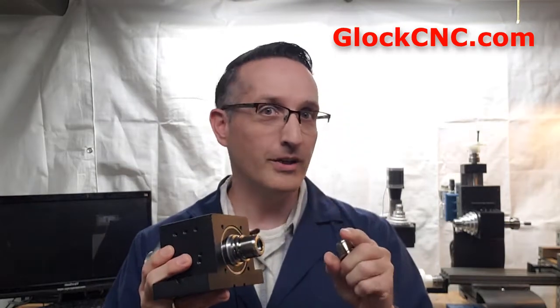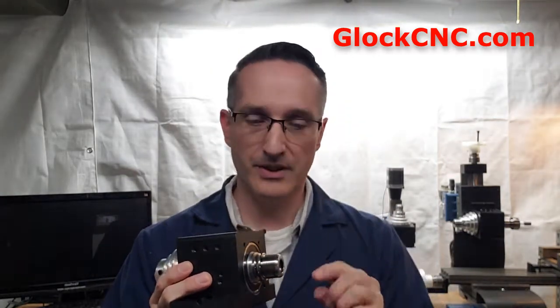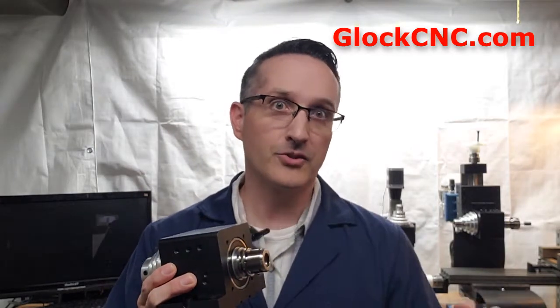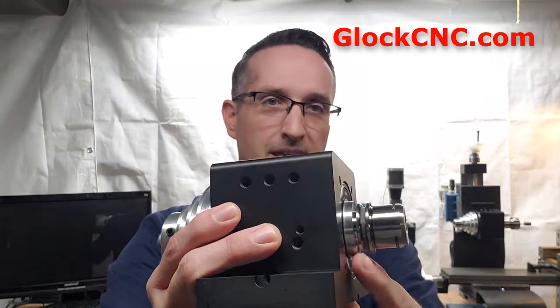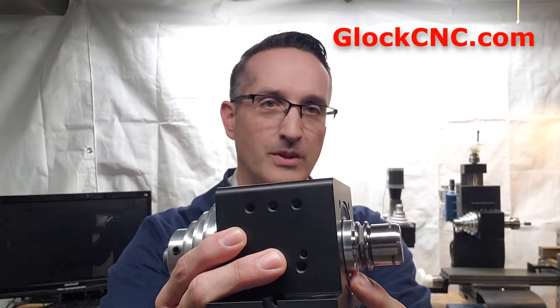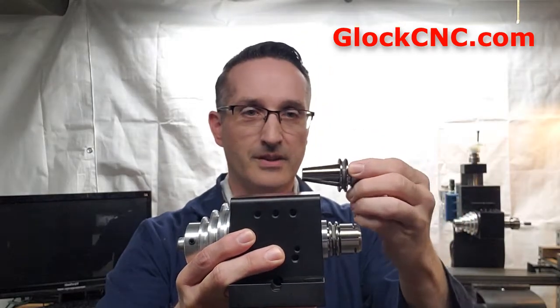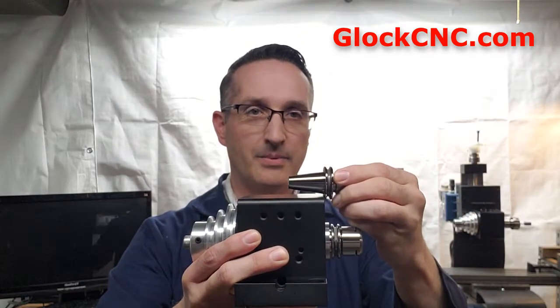The first thing I want to point out that's really unique about this is what's called a snub nose spindle arbor. You can see that's where the spindle ends. That means that this tooling taper fits up into the bearing, and that's really where you want your tooling to be — in the inside race of the bearing. That's where you want the pressure and that's where you want the load to be.